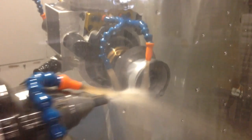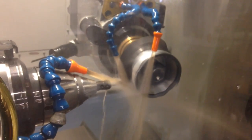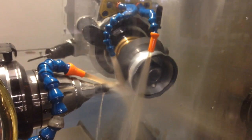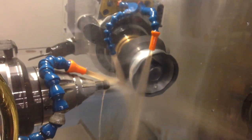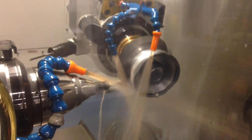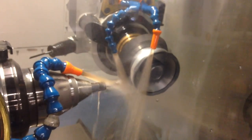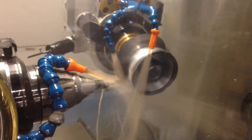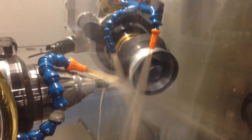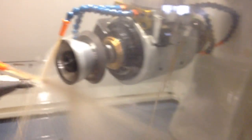I'm doing the primary now. Now it will gash the end. This is a typical end mill — two flutes to center out of four flutes total, so you get a good plunge capability and all that. Now it's going into the end gash.